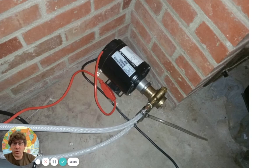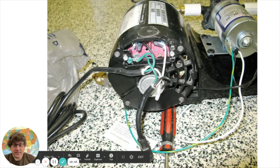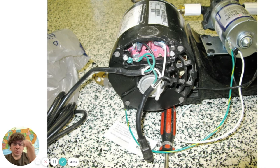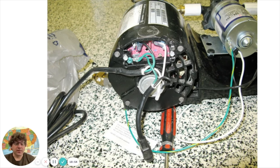Here's how the wiring harness can be extended. Extending it allows you to separate the tank from the motor. The wiring is super simple — there's a white, a green, and a black wire. As long as you connect the same on each side, you should have no problem. You can use any three-prong extension cord with the ground as one of the wires. It does have a clip, so I cut it, used a longer extension cord, and then reconnected it, retaining the original connector. This also makes it easier to disconnect and reconnect the motor from the float valve inside.